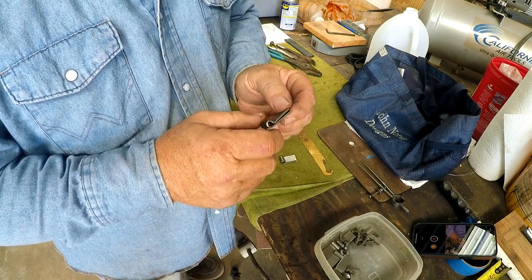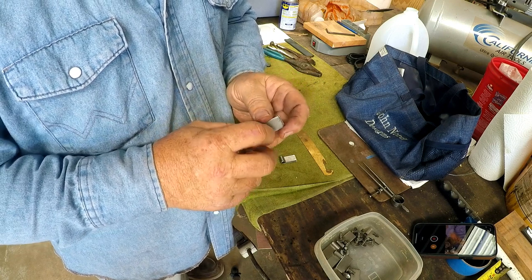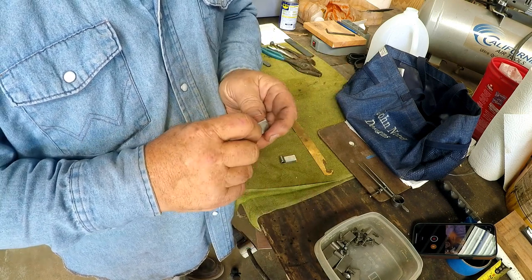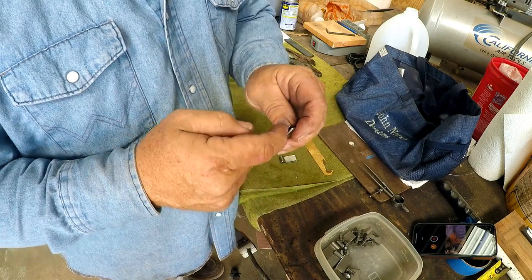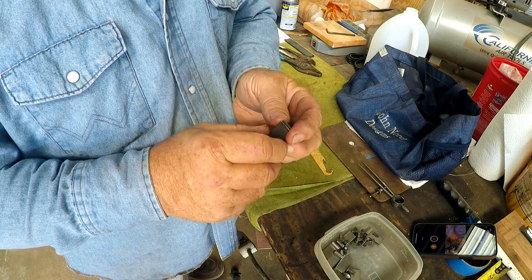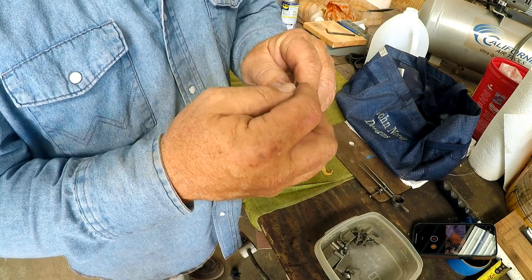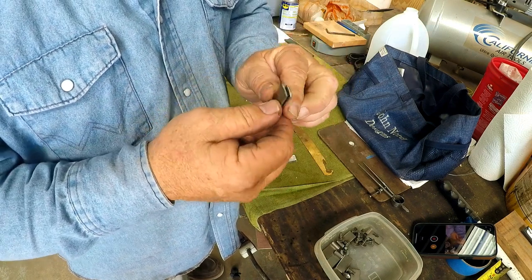And what I was taught to do is go ahead and put the hangers on the spur and brad them on and all that, get that all out of the way, polish the spur all up. And the last thing, take a wedge, hammer down in this opening here, open these swingers up, and then push them up onto the hanger, clamp them, put your button in there, and brad them. And that's the way I was taught.